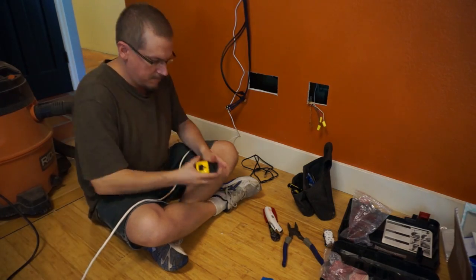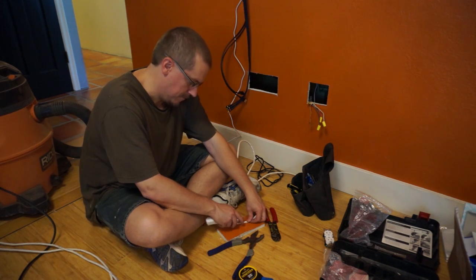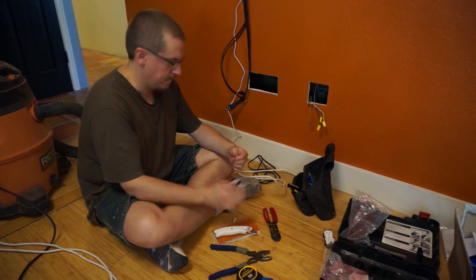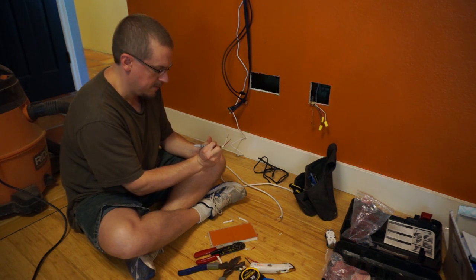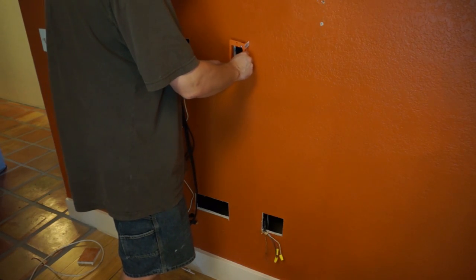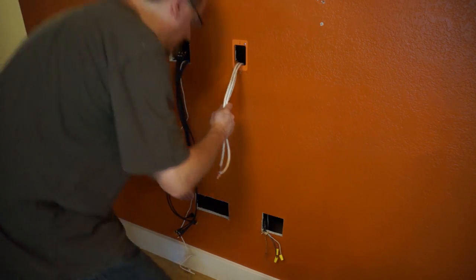The first AV cables I worked with are speaker wires — 4-conductor wire rated for in-wall use, around 14 gauge, left over from a previous project. I only needed two of the wires and so I snipped off the other two so there wouldn't be any confusion after the fact. I also labeled both ends of each wire with a Sharpie, since I long ago learned the hard way that unlabeled wires all look exactly the same after they've been snaked through a wall or conduit. I only needed a low voltage box for the speaker wires, and since my wire run is only a few feet in the same wall, it's trivial to route the wires. The wall happens to be over a foot thick, so any wires can simply run behind the studs if necessary.